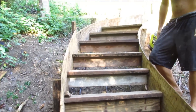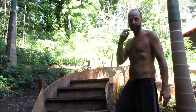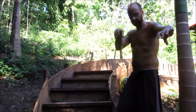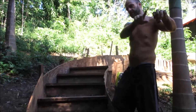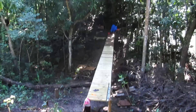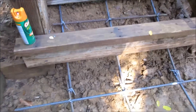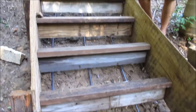Another important thing about making staircases — and this information is pretty much everywhere on the internet — is to do your rise and run calculations, where you figure out how high you're going and how long it is. You can take a two-by-four with a level on top and just measure down to the bottom of your staircase and then over. Use an online calculator to figure out your rise and run, put your stairs in. But this video is more to show you the formwork of how to do these concrete stairs. All the rebar is connected and tied together with tie wire.